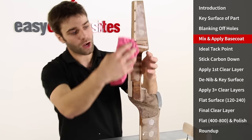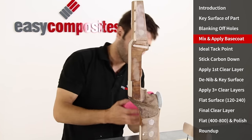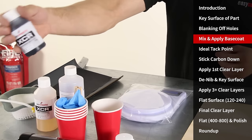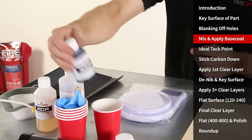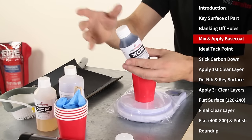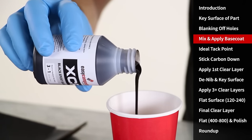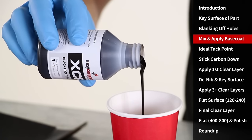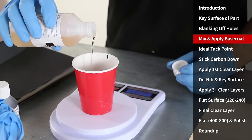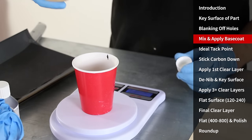I'm just going to make one final wipe down to make sure that there's no dust or flecks on the parts before applying the base coat. Base coat itself just needs a good shake before using it — that disperses the pigment — and then it can be weighed out and mixed with the hardener. It's very important that you always mix epoxy resins at the right ratio. In the case of the XCR skinning resins that is done at a ratio of three parts to one, so 75 grams of the resin goes with 25 grams of the hardener.